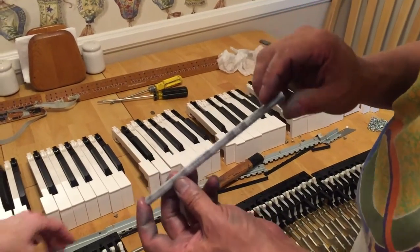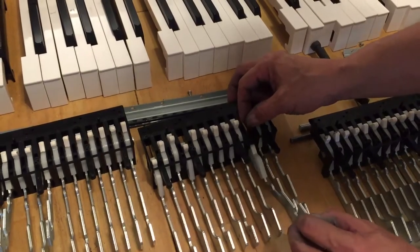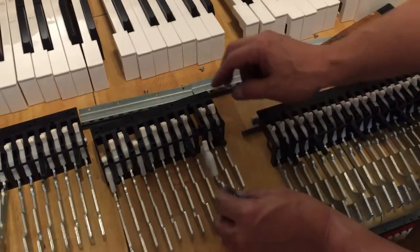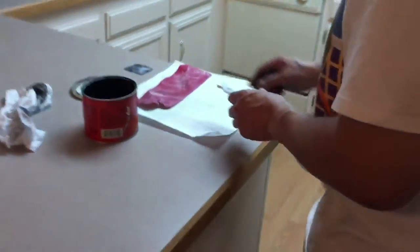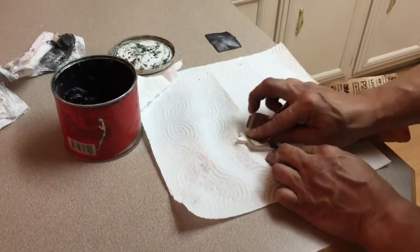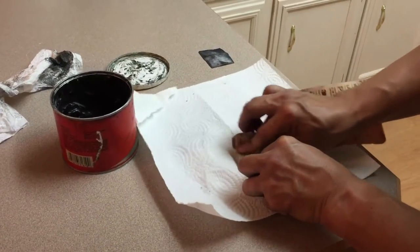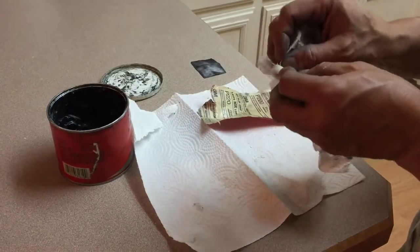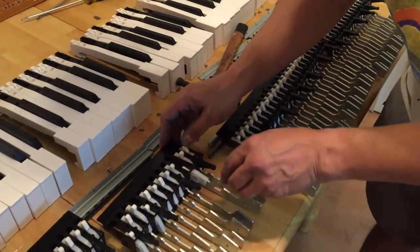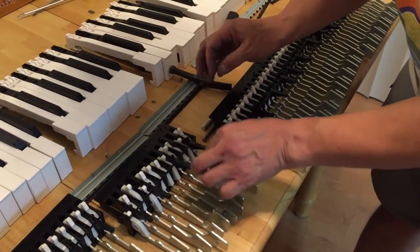We really need to just remove a slight amount of material. And then also these keys — if we look at them right now, some of them are actually really too tight in here. So what we're going to do is remove that key. This plastic may be causing friction if it's somehow warping over age. So the first thing we're going to do is take some sandpaper and go over this, just slightly removing a little bit of material. Basically, we're just going to try and clean the insides here, and then we're going to try to fit it back on. It's a very simple process. You'll see the key will fit nice and smooth — and it's not binding at all.